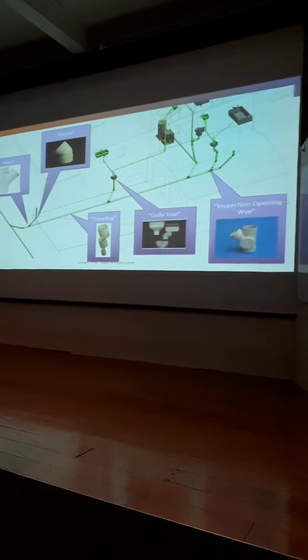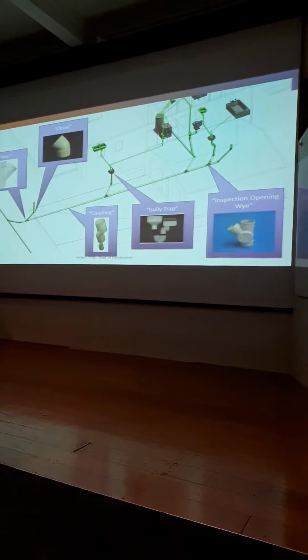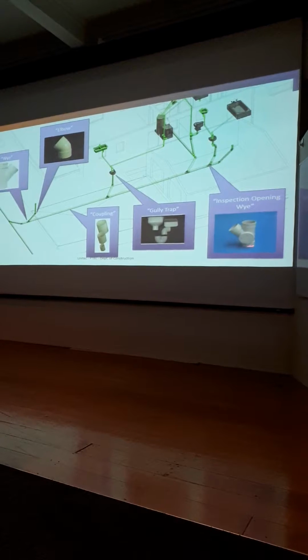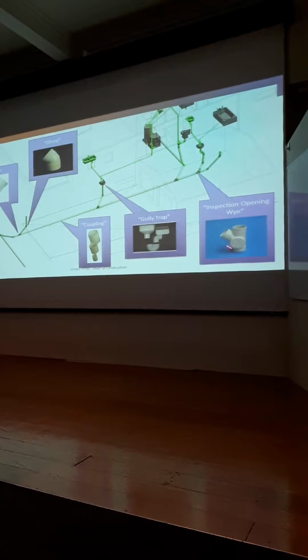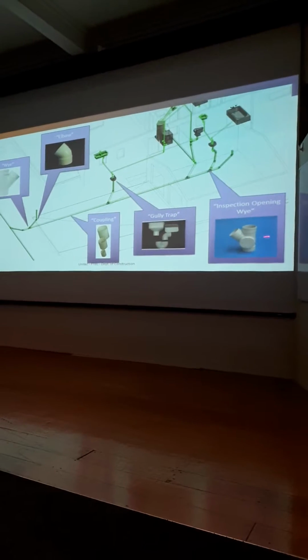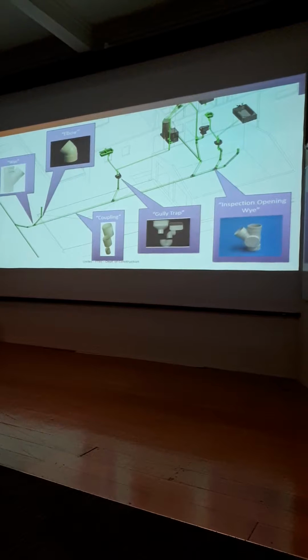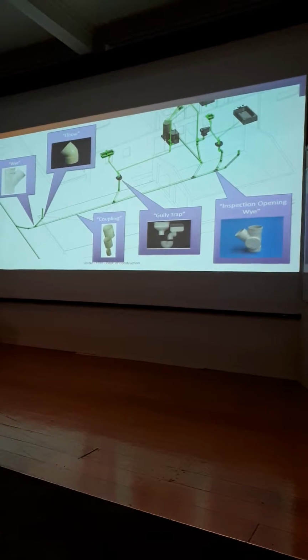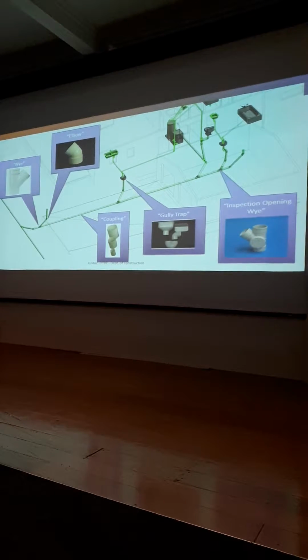So sometimes this is called a Y-bend, sometimes it's also called an inspection bend. IB, inspection bend. And that means at that point, or an IJ, an inspection junction, you can take that off without opening up all the pipes and look down and see if something's blocked, or you can run a pipe or a hose down there, or a rod. We call it rodding, generally putting a piece of wire down and clearing whatever blockage there might be.